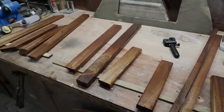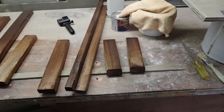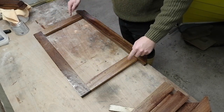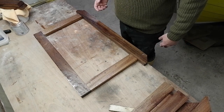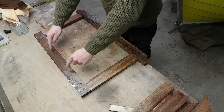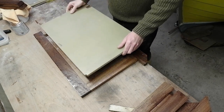Up here we've got all the wood that'll help with the front cuddy door, and basically what this will do is hopefully stop water penetration getting into the front cabin. Here's the front door itself — if you can imagine, this is the inside of the bulkhead. This wooden frame is where we're going to put in a new door for the front end of the bulkhead. It's to stop water ingress to the front cabin, so once it's located inside the bulkhead we put weather stripping around the top, and that way once the door is shut it's sealed and watertight.